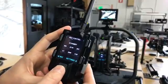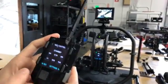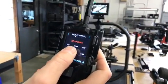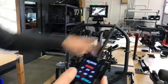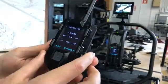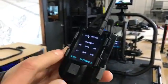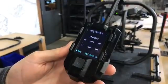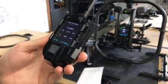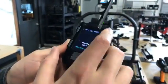So the ability, even just the ability to start stop. Oops, I hit the power button, not the start stop. So you can see feedback on the Mimic says recording. We're recording on the RED, ability to stop. And right now we've only activated the following RCP features: ISO, FPS, raw on and off toggle, Redcode, temperature, and shutter. But it's fairly trivial to add any of the other RCP parameters in the future for people that are interested in it.